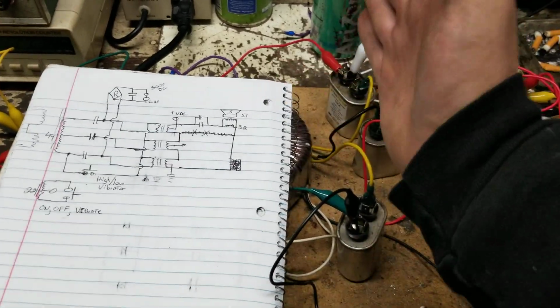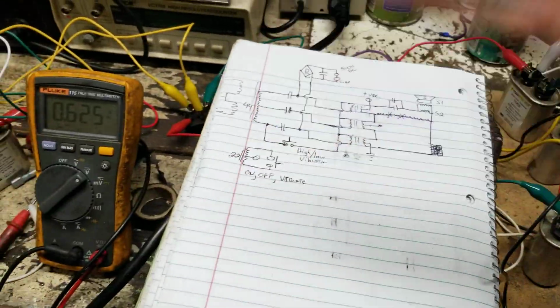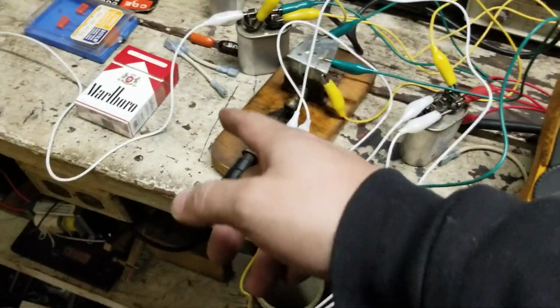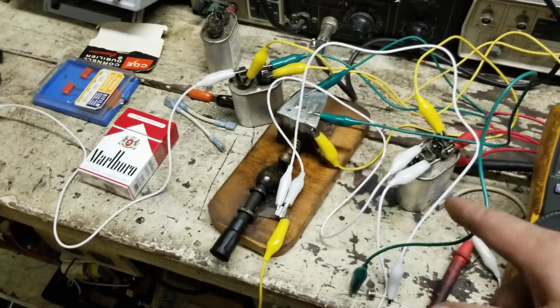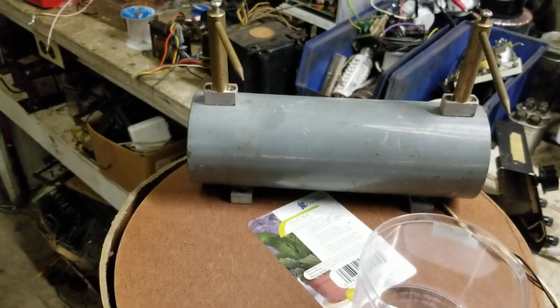where perhaps the quarter wave tap point is the highest voltage, which explains why I'm getting significantly more voltage out from this tap. And then it's to the point where it's enough to now start driving the circuit and filling up that 5 microfarad capacitor, and that one in series, enough to spark that coil one hell of a jolt.